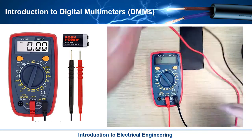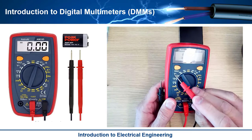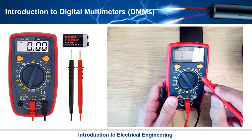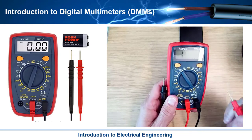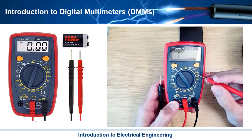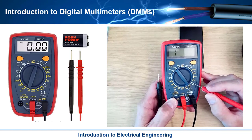So that's what continuity is. Looking briefly at the other functions — voltage is up here: it's a V with a flat line, meaning DC voltage, which is direct current, a constant voltage like nine volts from a battery. When you have the V with the squiggly tilde, that refers to AC voltage — voltage that alternates with time sinusoidally, like what you'd measure from an outlet in the wall. The ohm symbol measures resistance, and the A is current — this particular meter only has DC amperage. They all have continuity, and this one actually has a signal generator, which is kind of interesting.